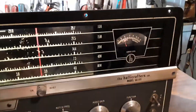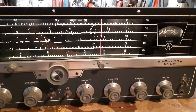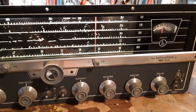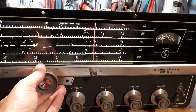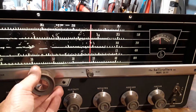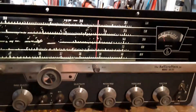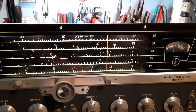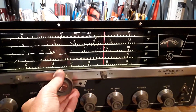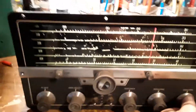The operator reports the signal is about five-and-nine on both antennas. The difference is explained: antenna one is about 12 feet above the ground, and antenna two is 100 feet up. That tells you the higher antenna is working okay. The receiving station confirms a good copy, and the signal is running a little over five-and-nine.